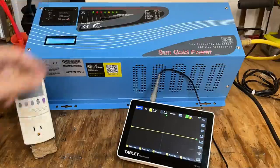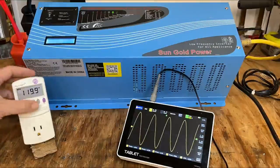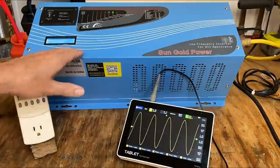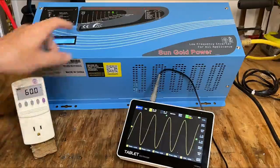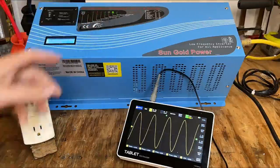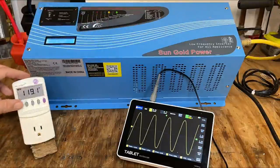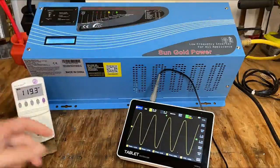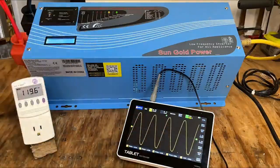All right, let's give this thing a try. Right now we're on battery power only, so the unit just powered up — 119.9 volts, 59.9 hertz. And here's a look at the sine wave — it looks nice and clean. The status light indicates we're powered by the inverter right now. So I'm going to plug in to grid power now and see what happens. Grid power is connected — there's a delay built in, so we're still running on battery power. When we switch to grid power you'll see the shore power light and the battery charge light both come on, which just happened. So now we're on grid power at 60 hertz, 119.1 volts. The voltage dropped a little on the grid, and actually the grid power doesn't look as clean — there's a little ripple on all the peaks. So yeah, the inverter seems to produce cleaner power.